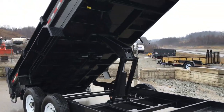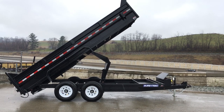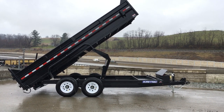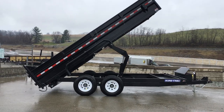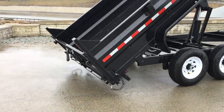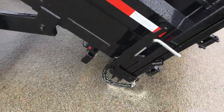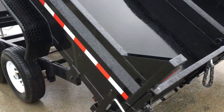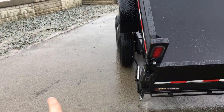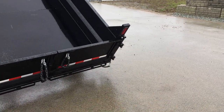The trailer comes equipped with two-foot sides. Two-foot sides used to be an industry standard — now we start to see some with 20-inch sides, but it still has the two-foot sides. Trailer weighs in about 4,000 pounds empty, meaning you've got about 10,000 pounds of legal payload and about 2,000 pounds of tongue weight. It comes standard with a combo spreader gate, or what we'd call a two-way gate. You can open it in barn-door style or come to the driver's side, set a chain, and tailgate your stone the way you want. The gate wraps all the way around the trailer — rather than coming to a 90-degree angle, it comes all the way around and chains at an angle. The problem with 90-degree gates is the operator often opens the door into a pile of stone and backs up without realizing they've tweaked their gate.